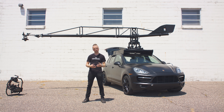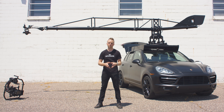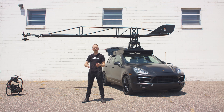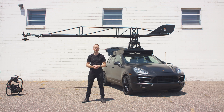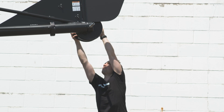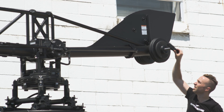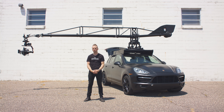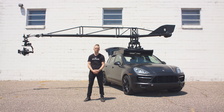Now that we've installed the LS kit and the full front boom set to build this 14-foot arm, we're going to add our payload and counterweight as instructed in the LS kit operation manual, because those ratios are different with the added length. First, measure your payload — in this case it's about 34.4 pounds, so I'll use the 35-pound instructions. Add the counterweight preload first, then mount the payload, then add the remaining counterweight for coarse balance. If your unit is INS2 equipped, add the INS2 sensor cable from the sensor down the arm to the serial port on the Radical base pedestal. After all cables are installed, power up the system and run a balance test to achieve fine-tuned balance on the lift axis.